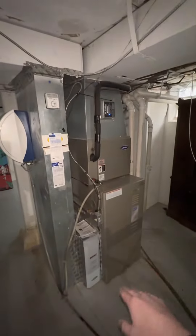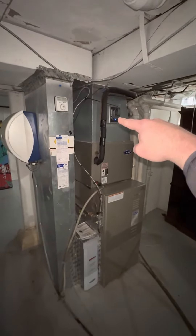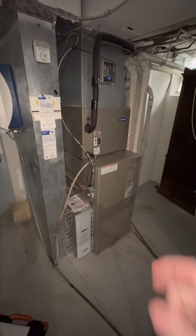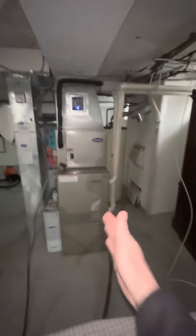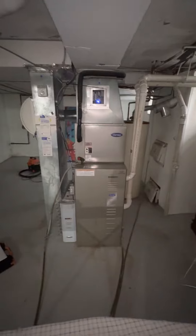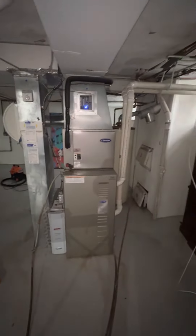This unit is a Carrier — C-width, 40 inches tall. The C-width coil is 17 inches tall. We do have an air scrubber we're going to need to remount. I'm not sure yet if we're doing C-width or B-width equipment. I would prefer to do B-width because it'll just line up a little bit better with the supply.